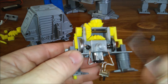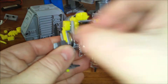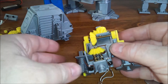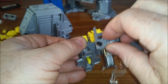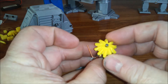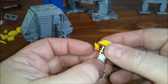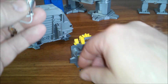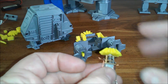Notice the relationship of the batteries to one another — they're both in the same orientation. If the motor were to run backwards, you could just flip that orientation the other way. There are the two terminals and the clamp. I've made the bevel gear to fit loosely on the motor shaft to avoid issues with the flat — it would be hard or impossible to drill out if undersized. There is a 3mm washer that goes between the motor and the gear, acting as a bearing.